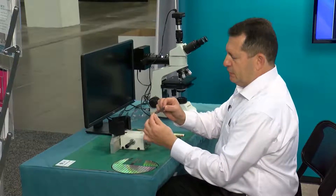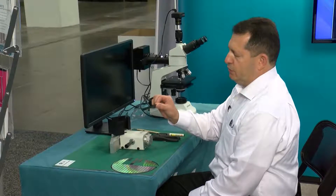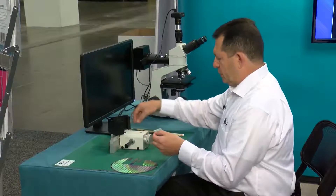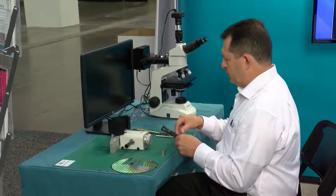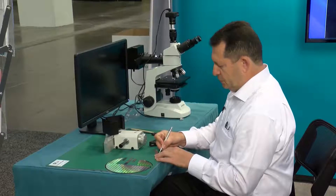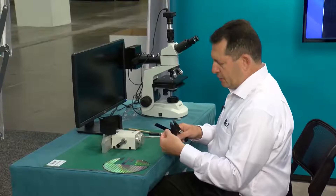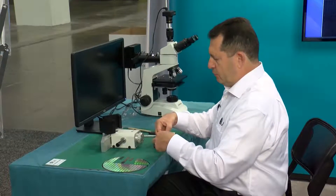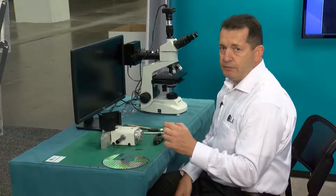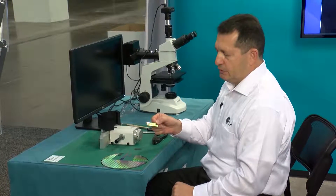In this case, you will receive a perfect edge cleaved through the crystalline plane of the silicon. After that, you can use manually operated cleaving tools you know well — a scriber and cleaving plier. Then you have your sample ready to go to the MC-10 with the marker inside.